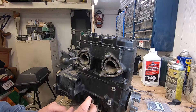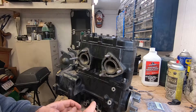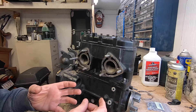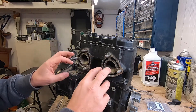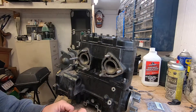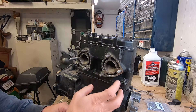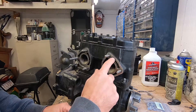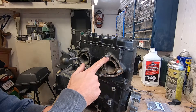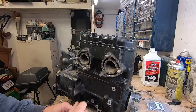So how do they go about trying to regulate the flow of cooling water through a watercraft engine? It's actually quite simple. The cooling water enters the cooling system through the water jackets around the exhaust system and then travels through the rest of the engine. What they do to restrict or control the flow of water is simply put small holes in the exhaust gasket. The exhaust gasket covers most of the water jacket and they just put small holes in there that restrict the flow.